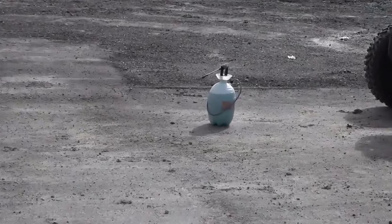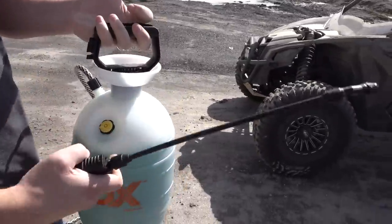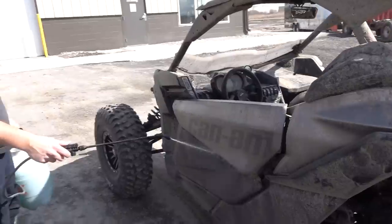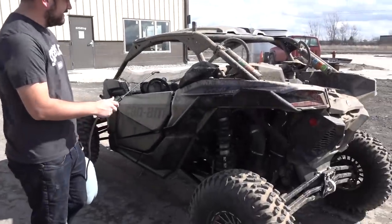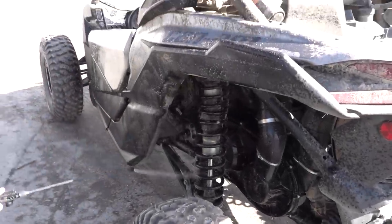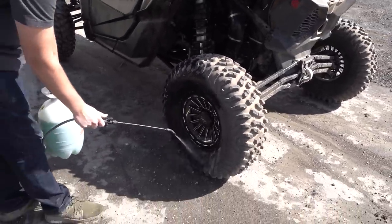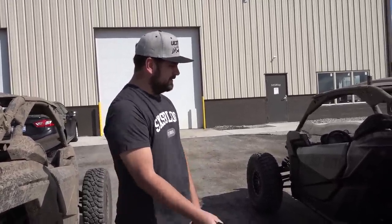And then it's time for some Simple Green. So here we've got one of these Home Depot garden sprayers. You just build pressure with this pump and it gives you a squirt nozzle. I like to really pour the coals to it and squirt the heck out of the machine. That's just Simple Green and water — one-third Simple Green, two-thirds water. Just come in and spray it all down. It's really important to get in there deep — engine, all that stuff, any sort of oil. Anywhere the mud's real thick, like inside the bead of the wheel, just saturate it up.